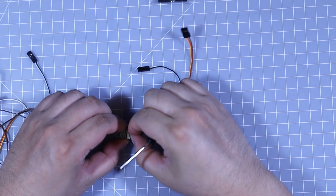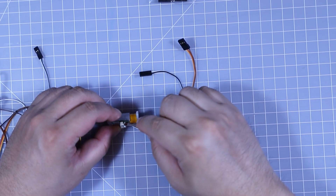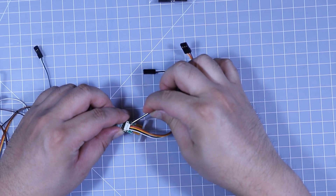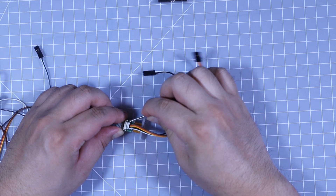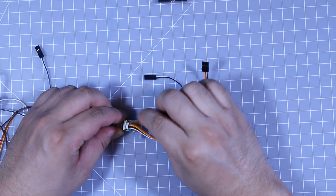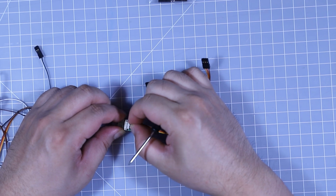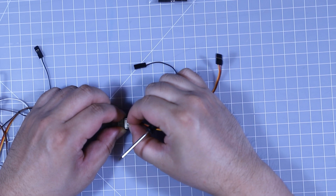Okay, so let's get started. Use it like a screwdriver and try to wedge in between the connectors and pull out the connector of the BL-Touch. Just be careful not to break the tabs on the side. Work from side to side and try to wiggle or wedge it out of the BL-Touch. Don't put too much pressure on it — if you do, you might actually break the tabs on it.